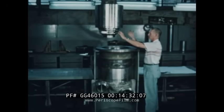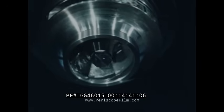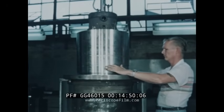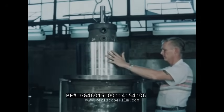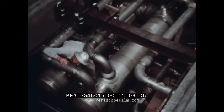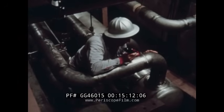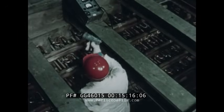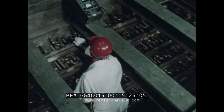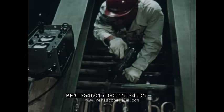The sodium pumps are modified hot oil pumps designed for high-temperature service in oil refineries. The principal modifications consist of vertical mounting and the addition of frozen sodium seals at the shaft and at the case. This pump will deliver 1,285 gallons a minute against a 130-foot sodium head. The intermediate heat exchangers employ a shell and tube counterflow arrangement designed in a U-shape, which conserves space and minimizes thermal stresses. All components requiring special cooling are served by a system which circulates liquid tetralin, a material which does not chemically react with sodium. The cold traps, sodium pump seals, top shield, concrete cavity liner, and fuel storage cells are among the components serviced by the tetralin coolant system.